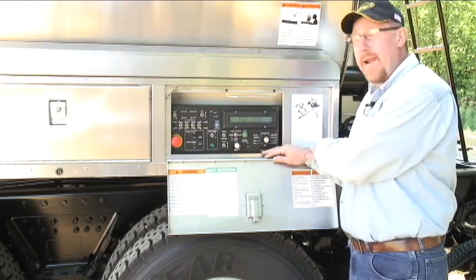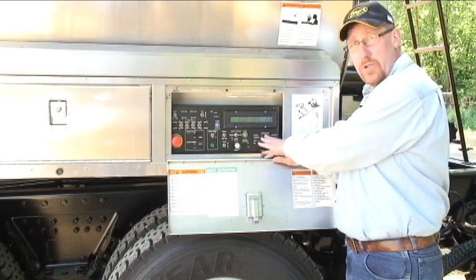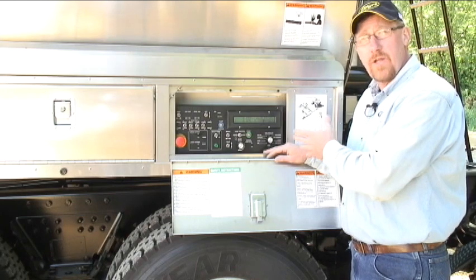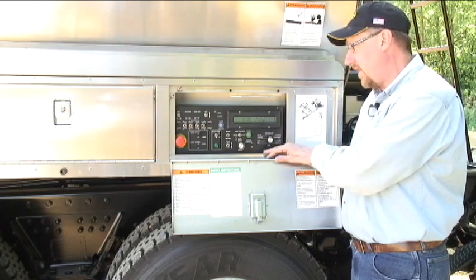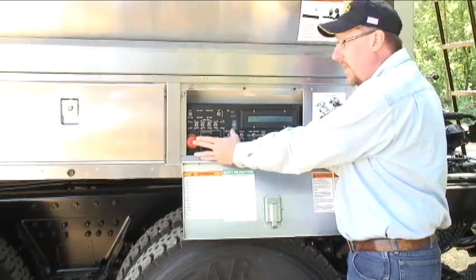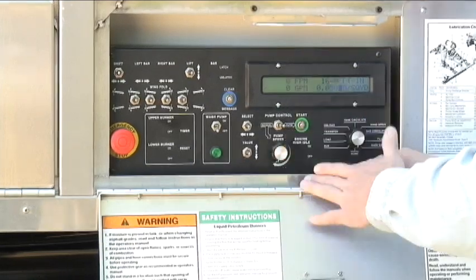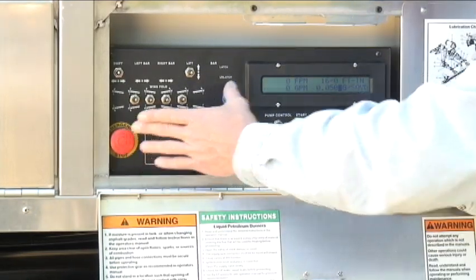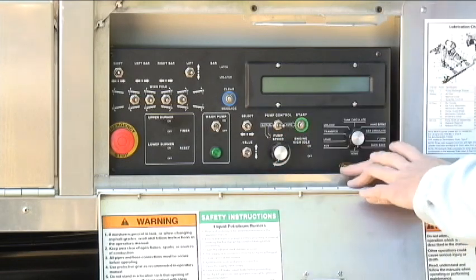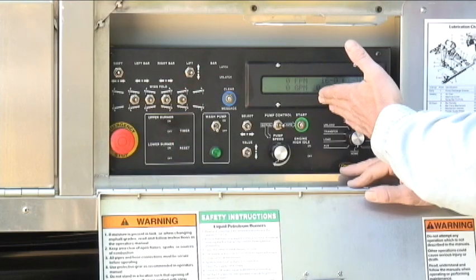Located at the rear of the unit is our main control box. There is also a control box in the cab, but the main functions are controlled from the rear since that's where the operator normally is. We first have a master or emergency shut-off switch — this is power. There is a master power switch in the cab box as well, and both have to be on before anything will work. If something were to happen and you need to shut the truck down, simply push that switch in and all functions of the distributor will stop. To release it, turn it clockwise and it will pop back out, regaining power and rebooting the computer.